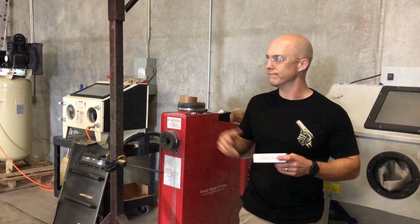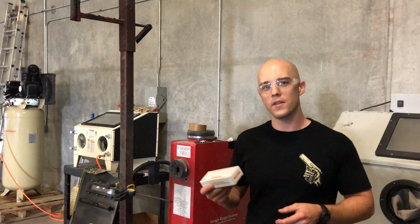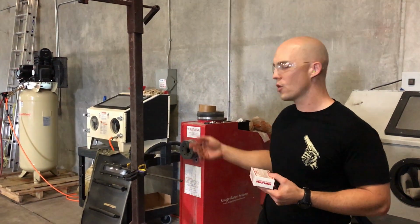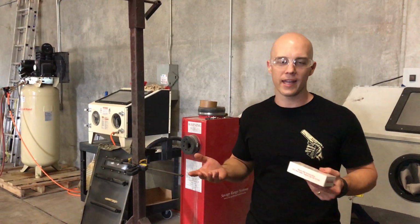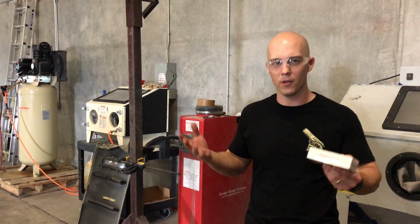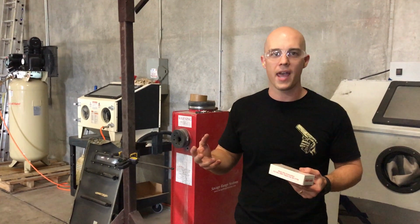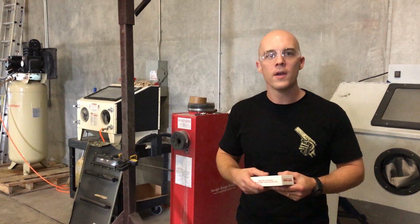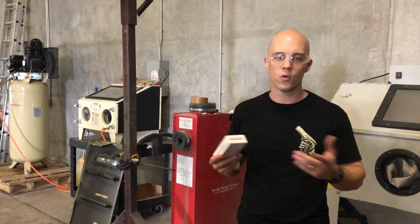So on this part of our testing, we're going to proof load test our barrels. One of the questions we get is whether the pocket cuts reduce the strength of the barrel. The barrel's a pressure vessel. It needs to be able to handle the pressure of the round, or if you're shooting +P or +P+ ammo, is it going to be strong enough? The answer unquestionably is yes.